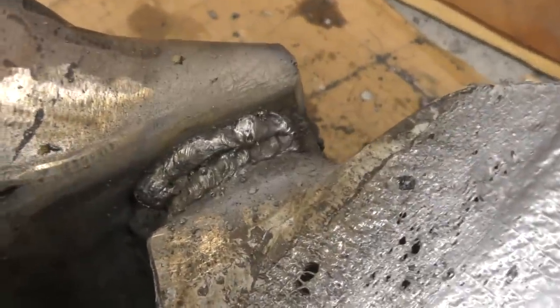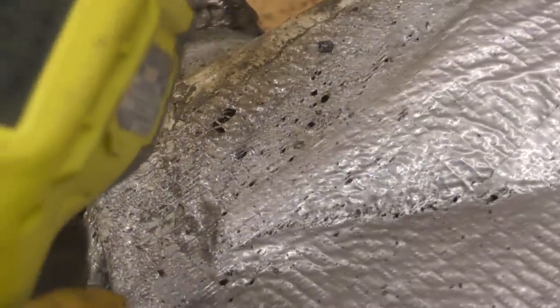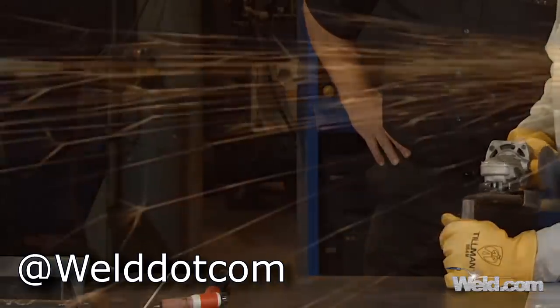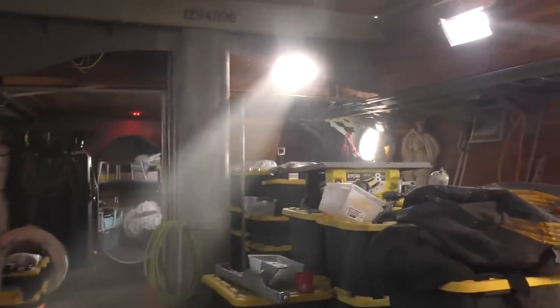It's coming off again — I think it'll be in pieces. The bolts went in first and got welded in. That preheated the casting to 200 degrees, so I didn't even bother with the torch. After some welding it was well over 300. It's at 360-350 right now, and I don't even know that this is really cast iron, because when I grind it it sparks just like steel — it doesn't have that secondary spark thing that cast iron does. I'm not sure, but it sure welded fine. I think our troubles are over, at least with it coming loose. It just got a little smoky in here.